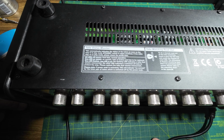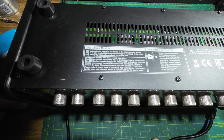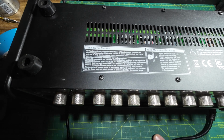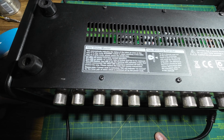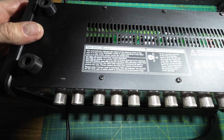One LED flashes and one LED is on. The flashing LED indicates a tube that causes overcurrent, and the other LED indicates a switched off tube to protect the amp. Please replace the tube that causes the overcurrent. Please note, if power soak is activated, TSC will indicate no current for the inner pair of tubes, which is switched off by the power soak. So I would imagine that's those buttons on the back then.